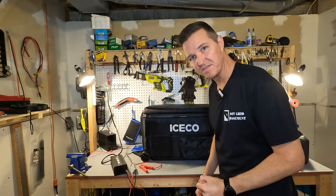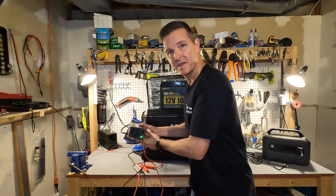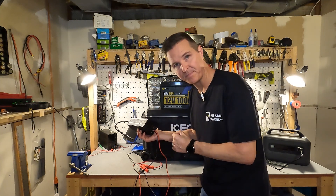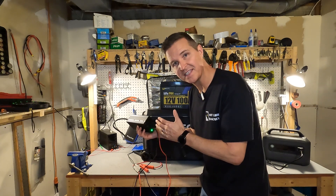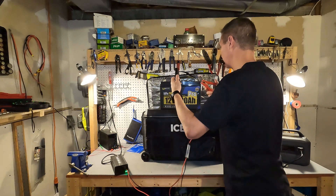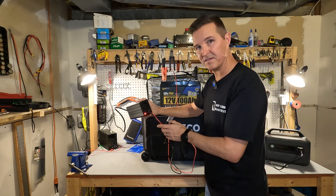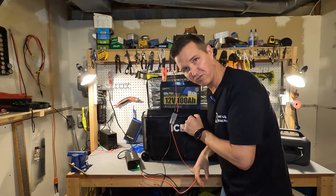It's been about 26 hours, so let's take the battery out and try to charge it with a LitTime 20 amp charger. The light is blinking green, which means it's on standby. I connect it — it turns solid red for just one or two seconds, then goes back to solid green, which means the battery has told the charger to turn off. This battery does have low temperature charging protection confirmed.